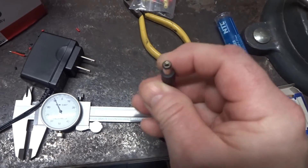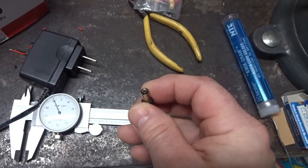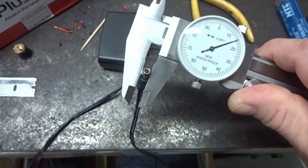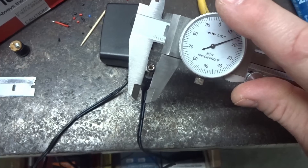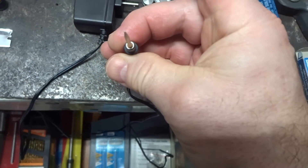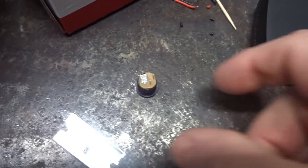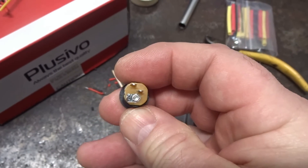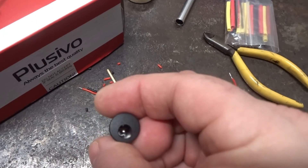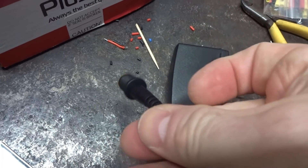When trying to find out what barrel size these are, you want to look for a 5.5mm diameter. If we mic this, you're looking at 215 thousandths — my other one was about 217 — so that's the outside diameter. To measure the little hole inside to confirm the 2.1mm, take a toothpick, cut the end off, and if it fits in there with no slop, chances are it's a 2.1mm. Here's that little jack — you can see the ground, then the top one is for DC, and on the right is for battery. This is a switchable DC jack.